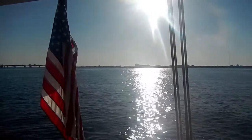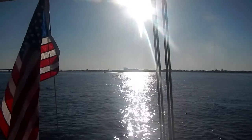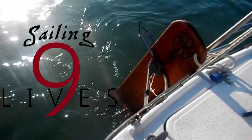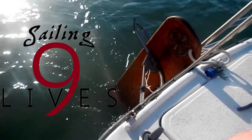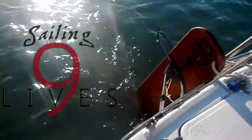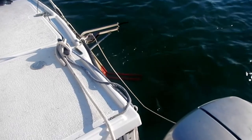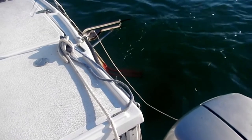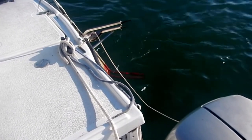It's morning at the Eastern Anchorage here in Cape May. I'd noticed late in the afternoon yesterday that one of the rudders was not performing properly. This is the port side rudder — it works fine, and that steering cable sticking out works fine. This is the cassette for the starboard side rudder; I took the rudder out. The steering cable sticking out there is not working fine. The end there is stuck, so I disconnected it from the cassette.